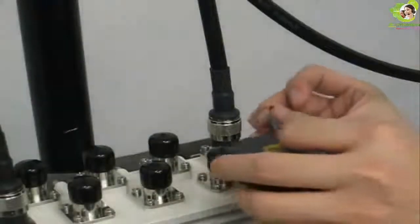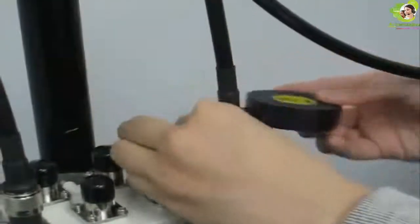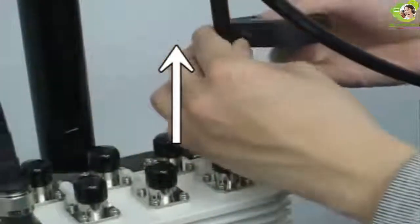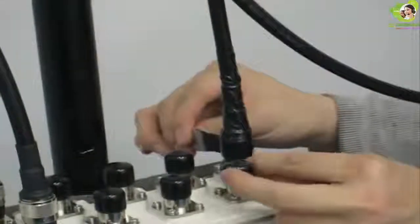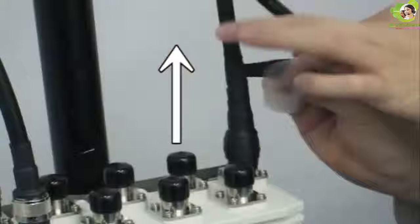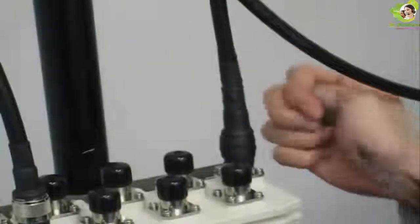After connecting one RF cable, you must wrap the RF cable with the sealing materials to ensure proper waterproofing. First, wrap the cable with electrical tape — this is to make removal of the waterproofing tape easier. Starting from the base of the RF port with one loop, overlap the tape to half width. The tape should cover the cable connector body and extend 25mm above the connector clamping nut. Next, wrap the cable with the rubber tape in a similar fashion as the first layer, finishing the wrap at 25mm above the electrical tape. Make sure that the cable connector to the RF port junction is tightly sealed. Press the tape against the cable connector body and the RF port.